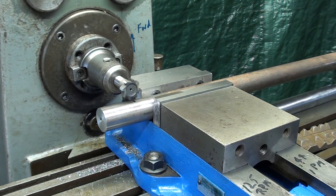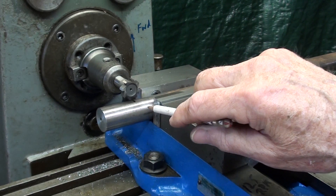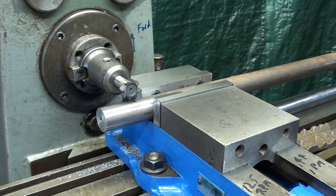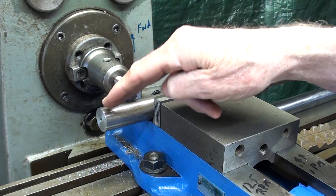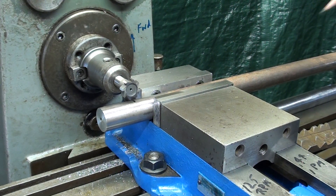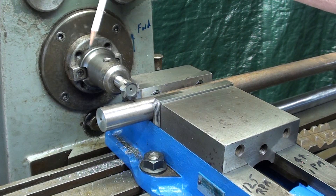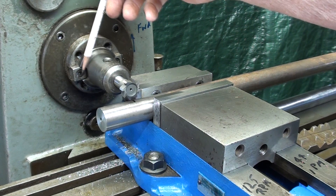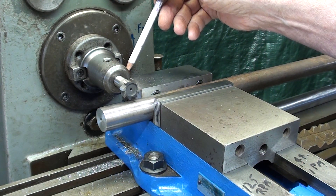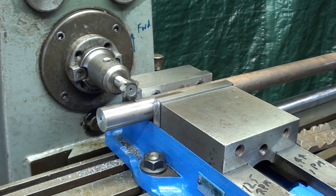But again, we have a little bit of a problem here on thinner stock. There would be so much overhang that it might vibrate, chatter, or move on you. Not so with the one inch — I'm not worried about that at all. But there's also a problem here of the reach of this tool holder, and that's a half inch tool holder. Do we have clearance right here? Is this going to hit the vise? So double check that before you get started.